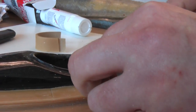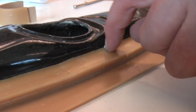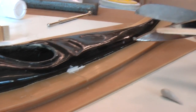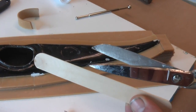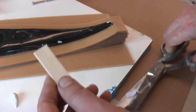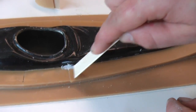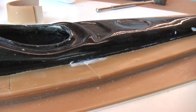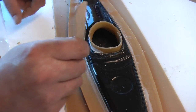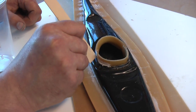On larger moulds, you can usually put just a slight fillet on using one of these fillet balls, also available in different sizes on our website. To push the plasticine into place, you can use a sharpened implement or just take one of the mixing sticks — we sell these on our website in packs of a hundred. They're quite handy for stirring, and you can also cut and modify them to use as a little tool to push the plasticine down the gaps. Just rub away any excess plasticine because you don't want that in your mould. Just follow that process all the way around to create a little flange around that opening on the model.